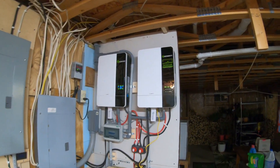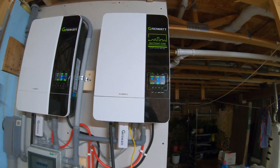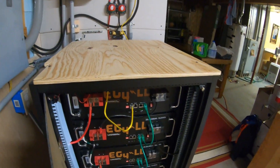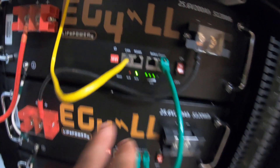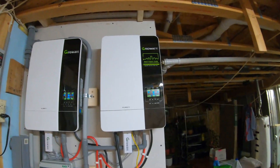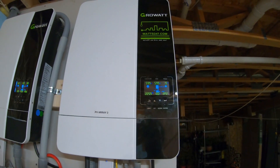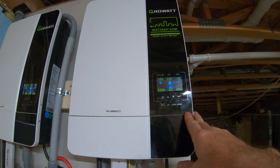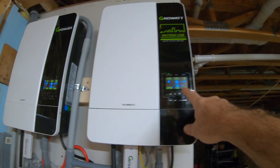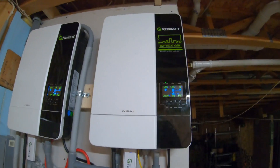The inverter just shut off and they're not making as much noise — it says my batteries are topped off at 100%. I'm not sure I totally believe that. What I've noticed is when the batteries go over 75–76% state of charge, this thing will show 100%. But if I set the inverter setting correctly it will actually charge them up to a true 100% and then shut off from the grid.